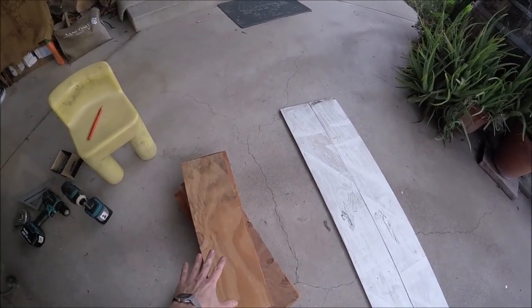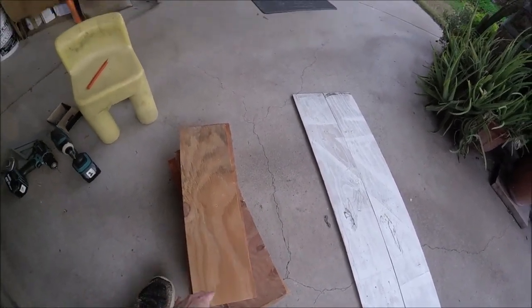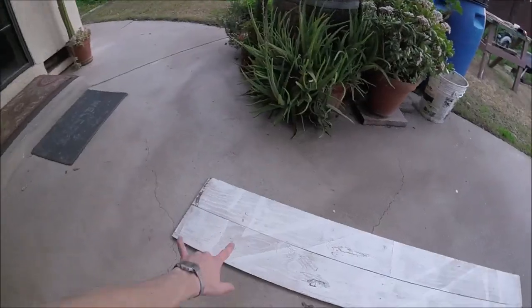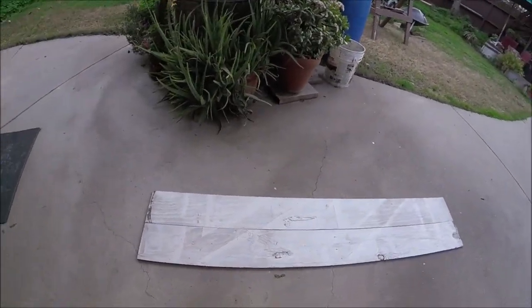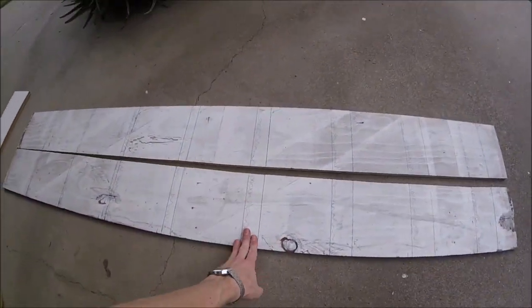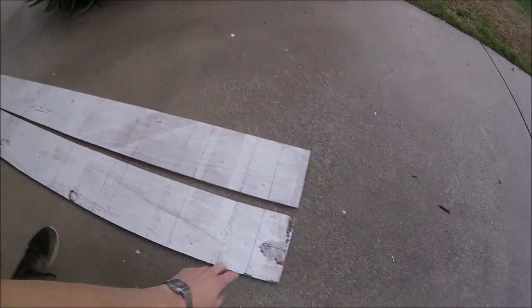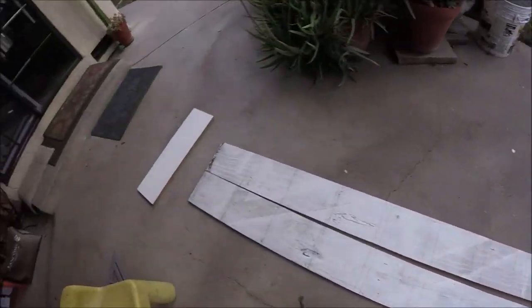I got all the shelves cut up. Go ahead and cut the depth a quarter inch less on the shelves if you're gonna put a back panel. I'm gonna mark off where the shelves are gonna go every 8 inches — that'll be plenty of room for our DVDs. I laid out all the lines for the shelves and I messed up — I forgot the width of the wood, so don't forget that. I got a little space at the bottom; I'll put a toe plate on after I'm done putting it together.